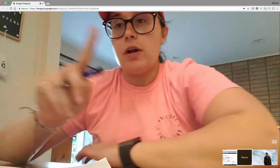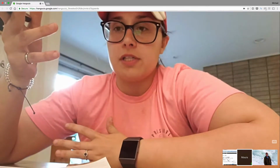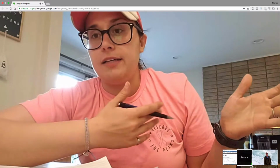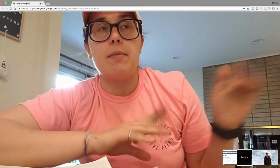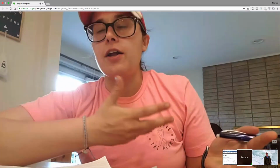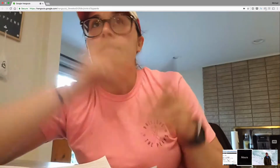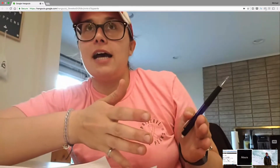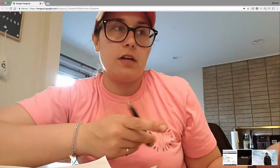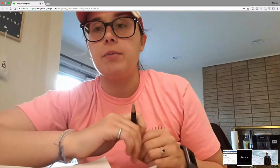Okay, that's one option. Another option is to design your own, which is what most teams do. If you're going to CNC it out at a professional CNC shop, you can be a little more crazy with your design. You can do intricate cutouts. You can have angles. If you're going to do it in-house, think about the milling process and how many setups you have to do to achieve those angles. Is it worth saving 2 grams for an extra 5-hour setup? Things like that come into play.